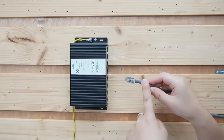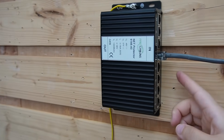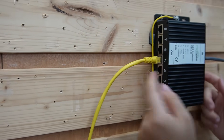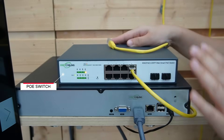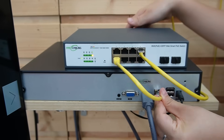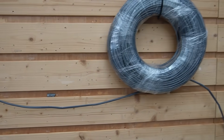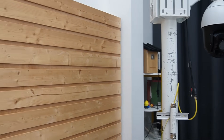We connect our 100m ethernet cable to the inside of the indoor surge protector — let's use port number 5. Make sure you ground it properly. For the outside, match the port: connect another ethernet cable to port 5 on the outside. Then use a short patch cord to connect to our PoE switch at the main control room, sending both power and data. Then another short patch cord connects to our network video recorder to display video footage. Now power and data flow from the indoor surge protector through the 100m ethernet cable, to the outdoor surge protector, and to our PTZ camera — fully protected.